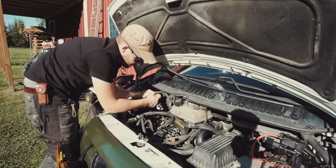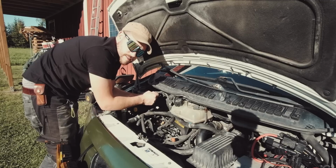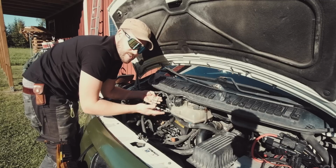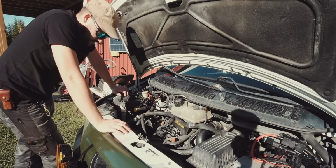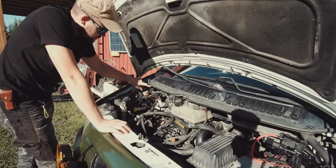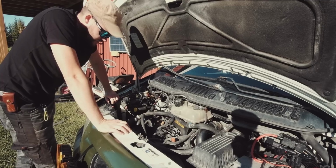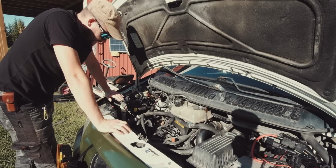They just took a knife, cut, took that section out and just wrapped the Webasto thing onto that and then left it on live main engine wires. It just, words fail me. So I ripped the old lot out and made a new one from scratch. But then the pump, I realised, was burnt out, which is great. So I had to order a new one. I'm waiting for that. But long story short, we're nearly there.